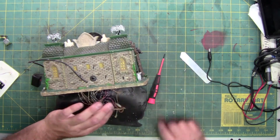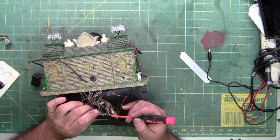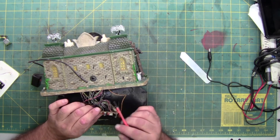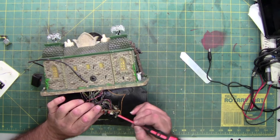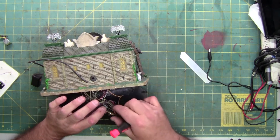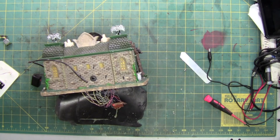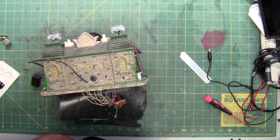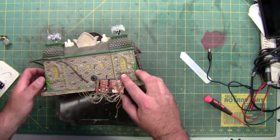The resistance level is the important part. When you do the transistor replacement, if you have to replace one make sure you replace it with the same one — the collector, emitter, and base are in different positions and they'll have different forward voltages for functioning. These are C1815s; if you buy something that's not the same it may not work, you may burn it up, you may damage the chip-on-board blob chip. It's a very standard part — I know I bought bags of them but I can't find them right now. I'm going to move my chair and try to bring this closer to the camera.